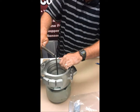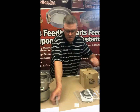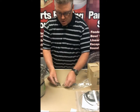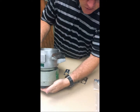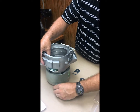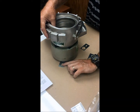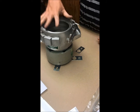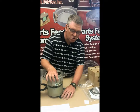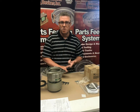The other thing you have in the package is what's called foot locators. There are three feet on the bottom of the unit — you can see one right here. These foot locators go around each rubber foot, and you slide them down to your base plate or table, then screw them into the table. With one around each foot all the way around the bowl, the bowl will not walk around — it stays exactly where it's supposed to be.